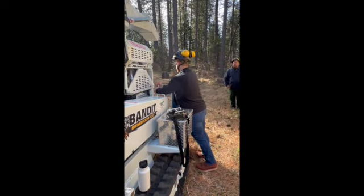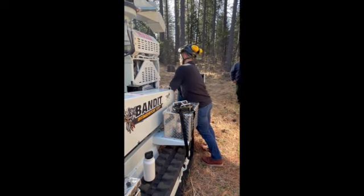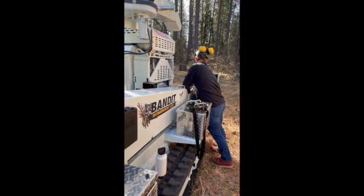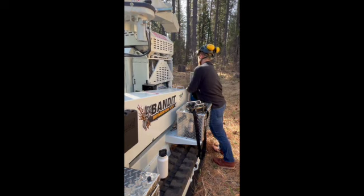So standing here, you want to hold your body weight against that handle because it's going to want to shoot down on you. So at an idle, we're going to use what's called the bump method. To right about here, you're going to hear those plates catching. That engine RPM is going to drop down a little bit. You want to bump this handle about 3 to 5 times.